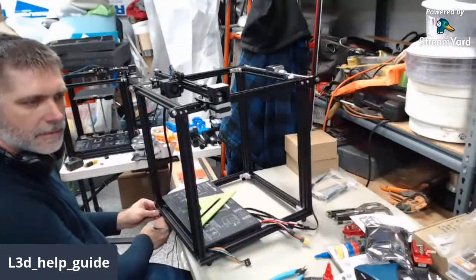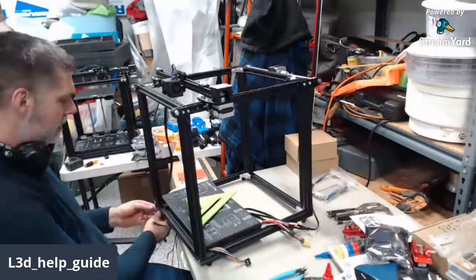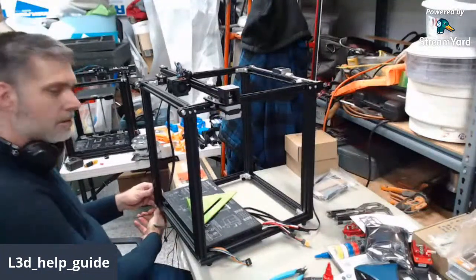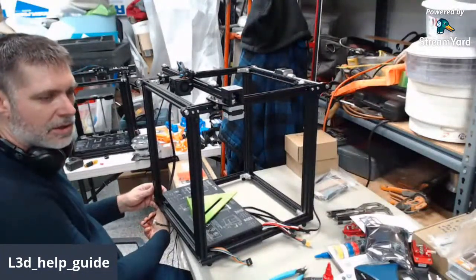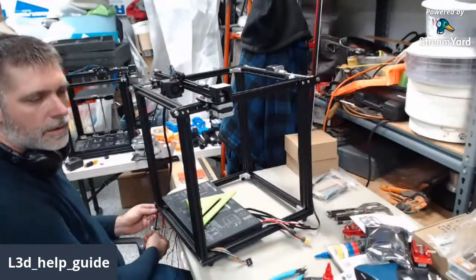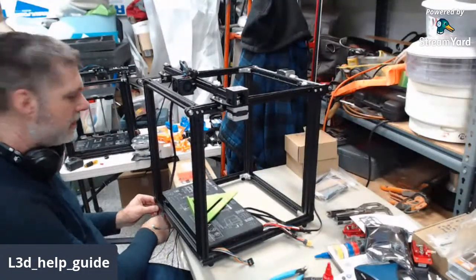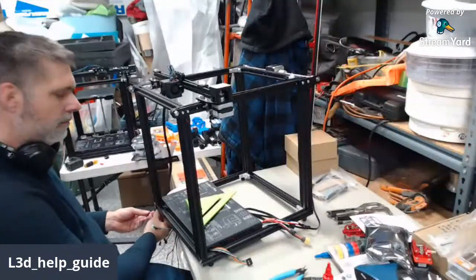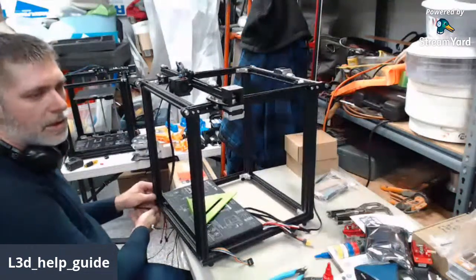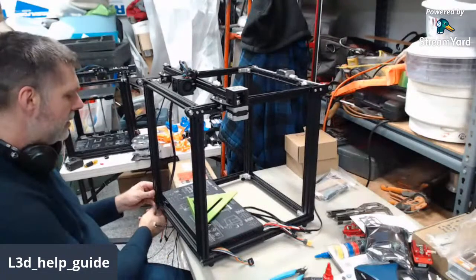Oh yeah, so you can print it from PLA. Here's the deal. Like a couple people have said, "Oh, I did it, and the little washer melted." Right? So half the time the washer didn't melt. When you use this fix, I'm getting ready to add to my instructions on it. But I make the hole for the PLA coming back about 2 millimeters, which should be more than enough to pull filament back out. But just to get it back out of the machine cleaner, when you go to remove your filament, push to extrude for about 3 seconds, and then swiftly pull back.